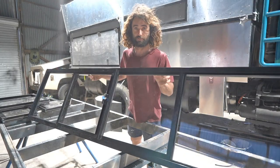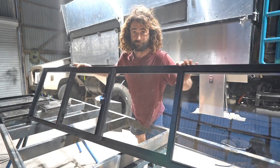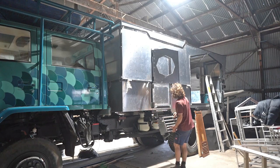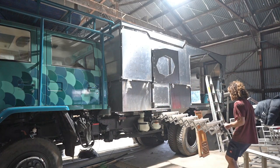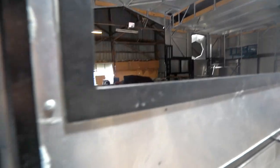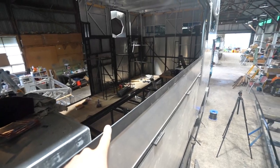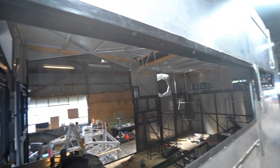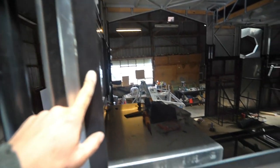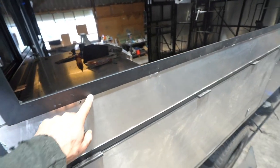And that's it — one aluminium domestic window with glazing. Now we've just got to glue them in the truck. These are the aluminium frames I made for the windows to go inside. I've made another video on making these. Basically it's just aluminium T-section welded into the shape of the window and glued onto the external cladding of the truck, and then the window glues inside there.